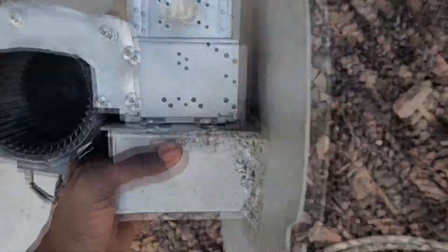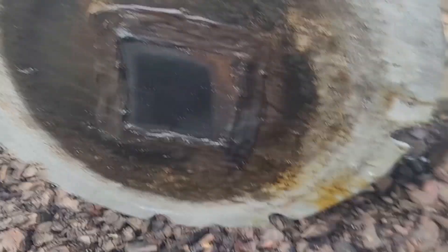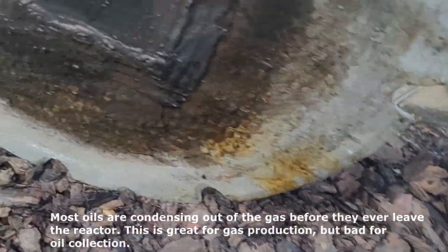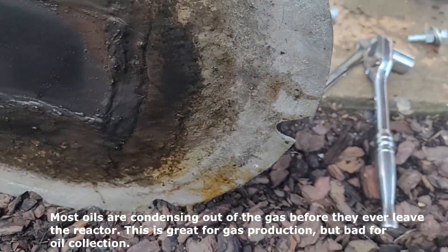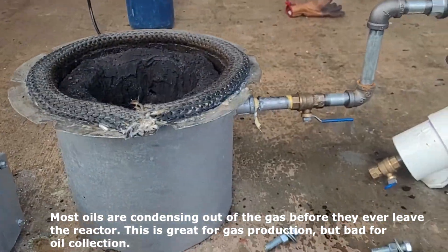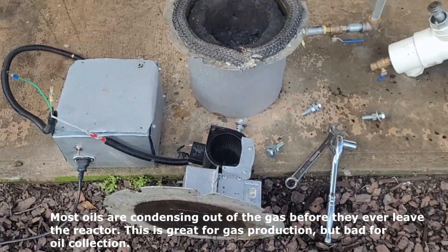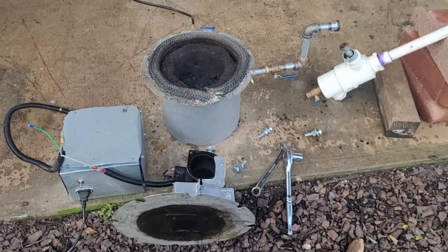Anyway, we have it. Take the lid off — I want to design a little arm for the lid so it stays held up. This is what it looks like on this side. There is a lot of oil on this lid. Can you see that drop right there? There's a lot of oil. This is the wave guide cover, which is a mica sheet with JB Weld extreme temperature. You can see the oil dripping down. What I assume is happening is a lot of this oil is getting reflux condensed back into the reactor because the outlet port is on the side — the vapor wants to travel up, and by the time it reaches this lid, the lid steals the heat energy and condenses it right here. That's not what I want, even though refluxing does give you higher gas production. If I ever want to actually collect the oils, my oil yield will be extremely low or null.